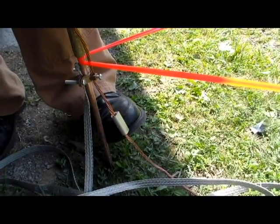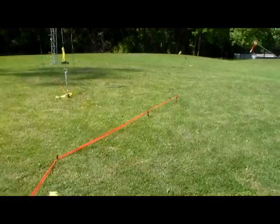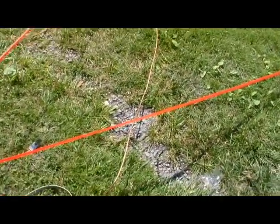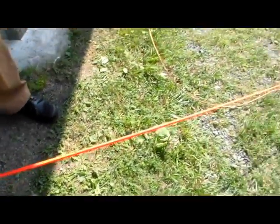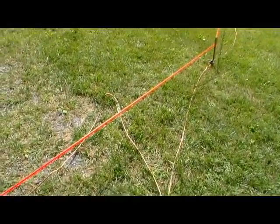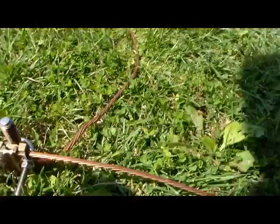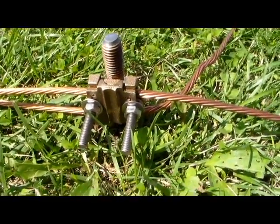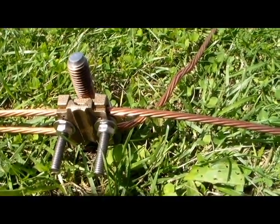The grounding array consists of those rods in a V-shaped pattern out there, with a copper wire laying right on the surface of the earth. Each rod is twice its own length apart from the previous rod. When we install the clamps, whether they're acorn clamps or these larger 305s, we shine up the rod or burnish it with a piece of emery cloth, because while the rod's in storage it develops a coating of copper oxide that doesn't conduct real well.